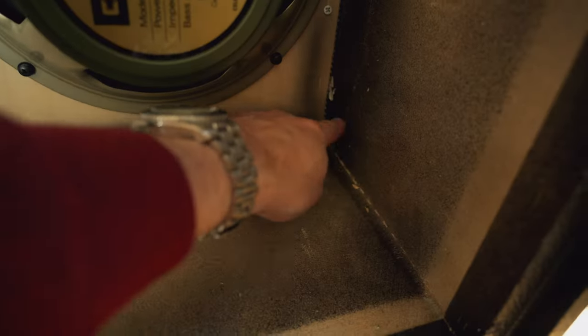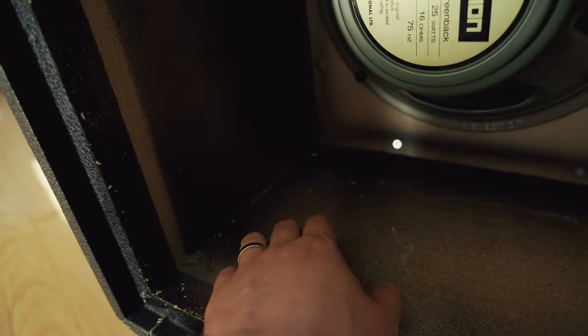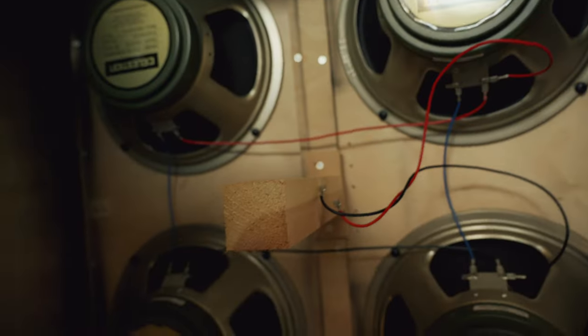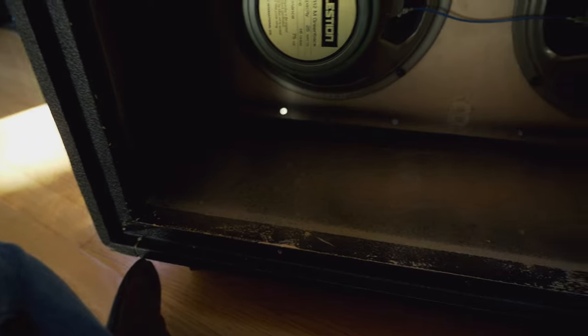So I think the plan of attack will be to drive some of those L brackets in here, maybe three on each side, to make sure it's nice and strong. And maybe we tip the cabinet over on its side when we do that. It'll kind of act as a clamp, because I don't have a clamp big enough to go across the bottom of that cab there. So we're gonna save this thing though. We're gonna save it though.